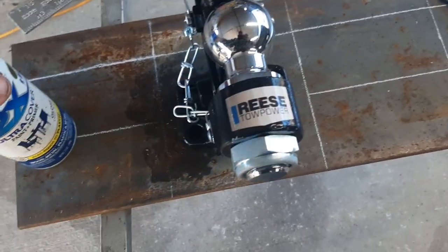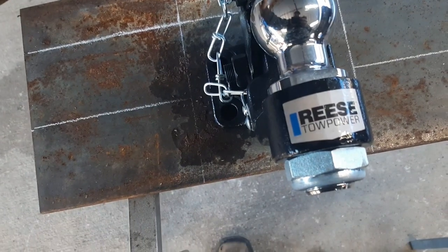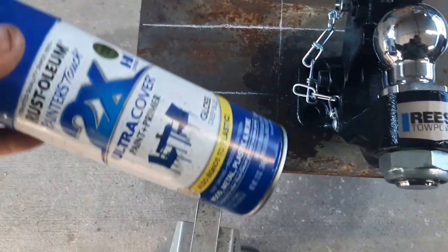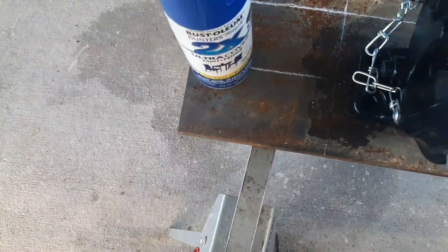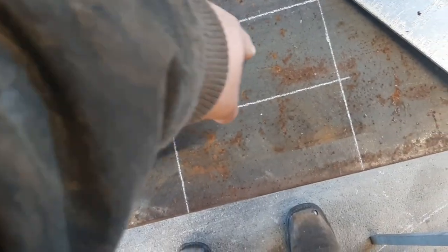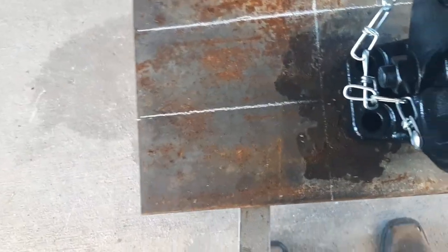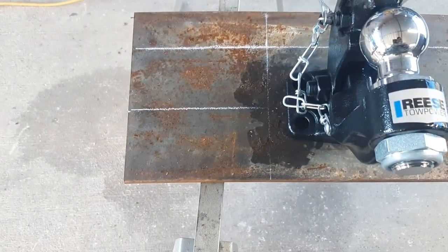You can see the quadrants of a 6 by 6. The center one doesn't have a horizontal line going through it; the outside ones do — that marks our center. So we put our round jig — in this case I'm just going to use a paint can — center it, draw a circle around it, then put it over here and draw a circle around it. Then take the straight edge, go from the corner where it intersects into that circle, and do that on all of them. Without going into too much math, that seems like the easiest way to get something nice and even.